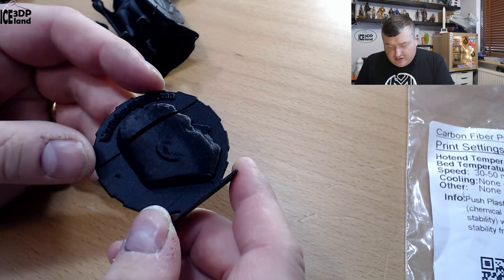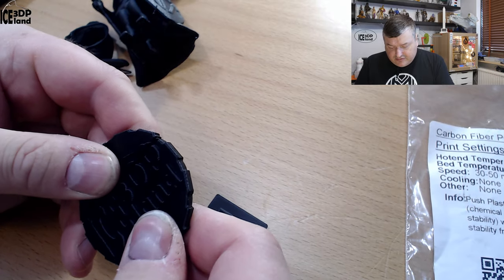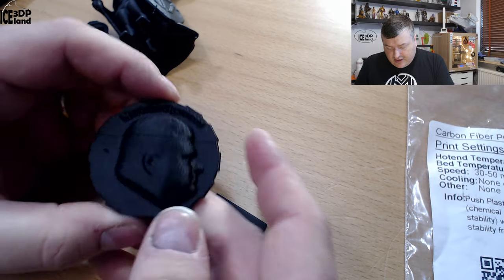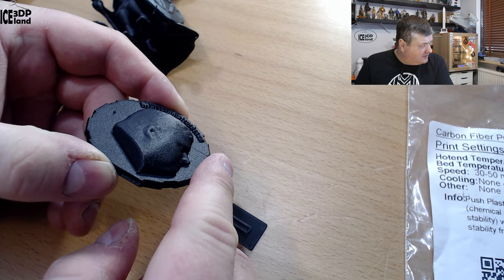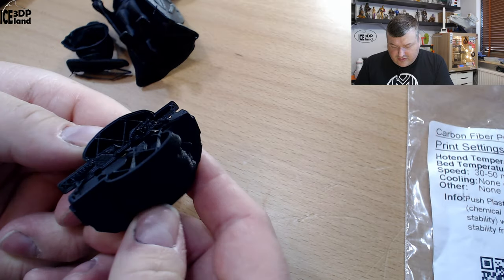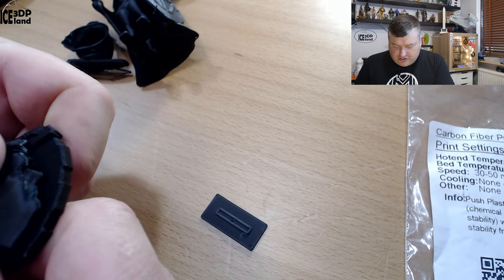It's really like a matte black and really cool, but this was giving me trouble. I decided to print my maker coin with about 15% infill to see if that would make it stronger, but still layer adhesion was a problem. The print quality other than the layer adhesion is really good — it's a matte finish — but layer adhesion was giving me trouble. You can see the infill; it's just not strong.